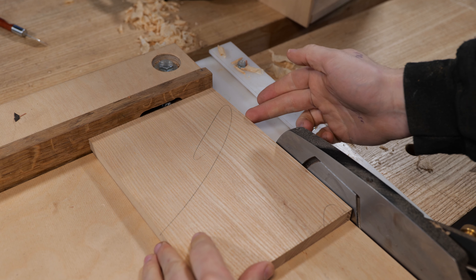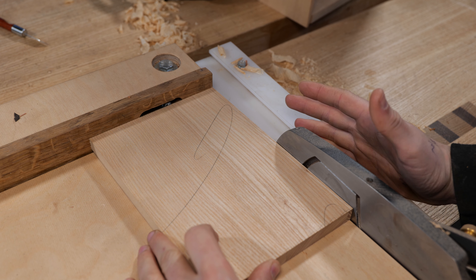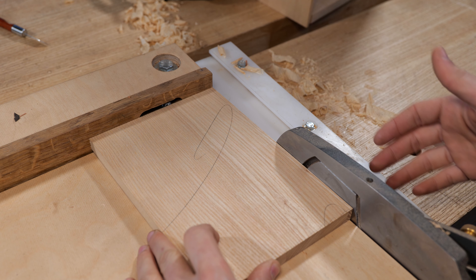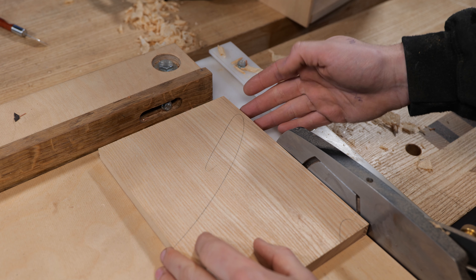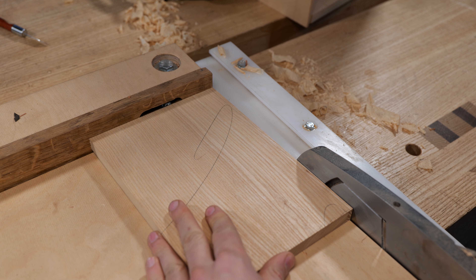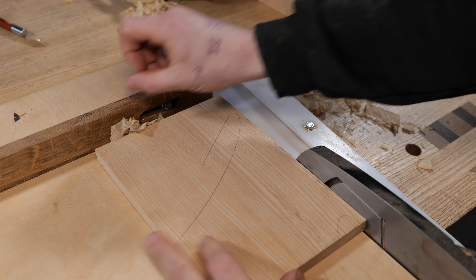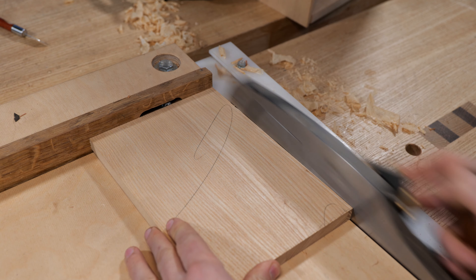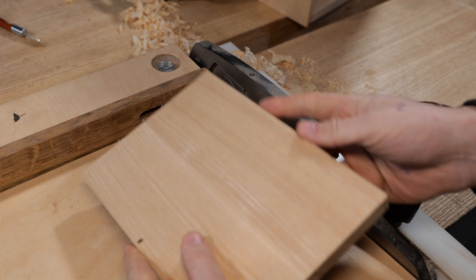Back on the shooting board to plane back to that knife line. In the first part we did this with a long grain shooting board knocked together for demonstration, but you can use a normal shooting board as a long grain shooting board providing it's long enough. I'm not relying on that edge giving me a true square edge — because I'm not referencing off my face edge I don't want to be a hundred percent reliant on it. So as I'm planing I will be making small adjustments to ensure I hit that line evenly. You can also get little shavings and stuff them behind the piece to slightly angle it if needed.